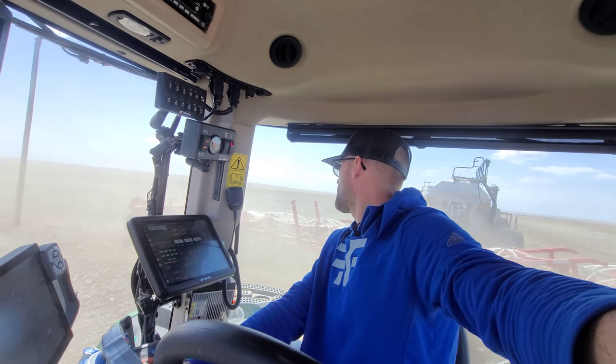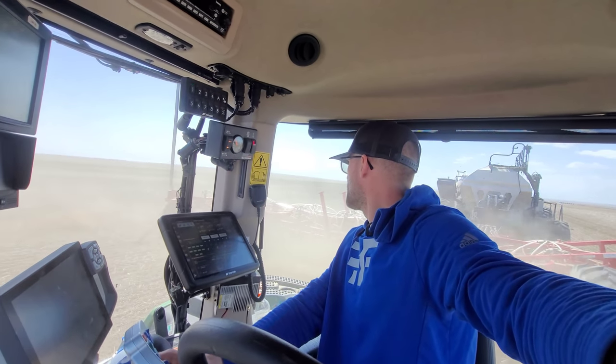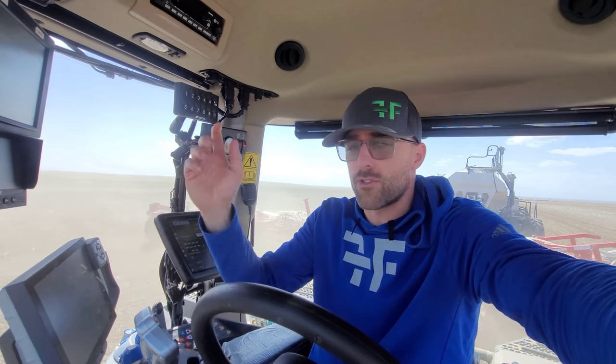Whichever side you need to have the most attention to detail - maybe it's the most sensitive to drift, maybe you got a border up against someone else's field - always work with the wind. You have way more control of spray drift going with the wind than if you turn around and go against the wind. On that first pass you need to be very careful - always work with the wind on that side. If you happen to be on a field where both sides need to be careful, then you drive back unspraying. Normally once you get a whole sprayer boom at 120 feet, you're off to the races. If you need two sprayer boom widths just to control your wind, you're probably a little too windy to be out there.